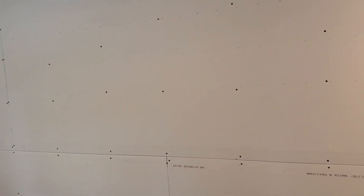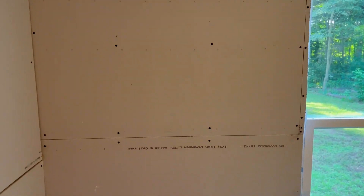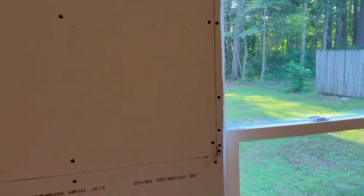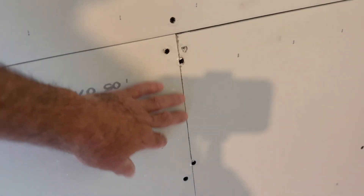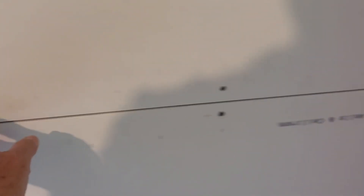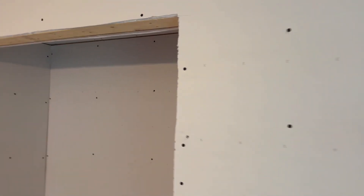So it took most of the day, but it went pretty well. We decided to lay the drywall down horizontally because you get fewer seams. A lot of people stand them up because it's less than eight feet, but then you'll have a vertical seam every four feet. And here we only have a vertical seam every eight feet, and it's only four feet long. And then you get this factory tape seam right across the middle horizontally. So it's kind of better this way. We just simply put a whole piece on and then cut out the openings.